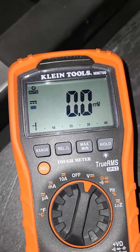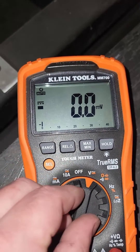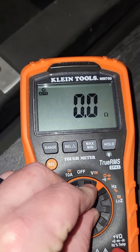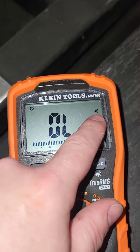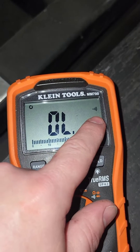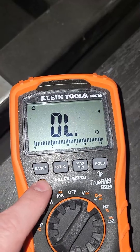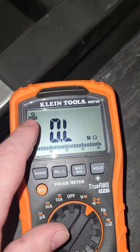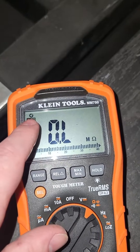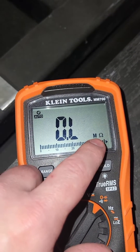When we're ready to measure the resistance — the ohms — we're going to set the meter to the ohm symbol here. This first ohm reading that has the little sound buzzer icon is for continuity. To measure physical ohms, we're going to hit select again, and then it changes the meter to auto range, and you'll see it defaults to just the omega symbol.